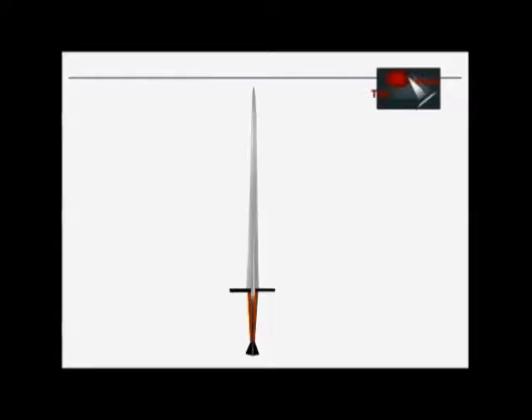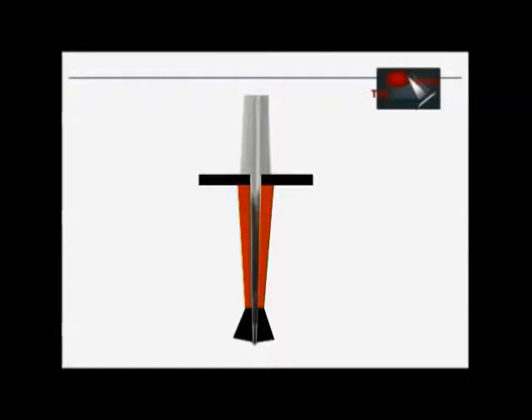I limit this observation to the typical cross guards on medieval swords. A cross guard has the main tasks to protect the hand and to stabilize the blade by pushing against its shoulders, and providing at the same time a protection layer for the grip. Because with a direct contact of the blade shoulders with the wooden grip, the blade shoulders would drive themselves into the softer wood. The small tang will also be supported by the cross guard through its inside that stiffens and strengthens the tang by surrounding it.